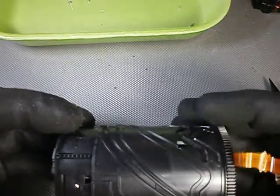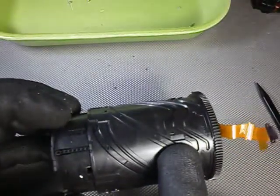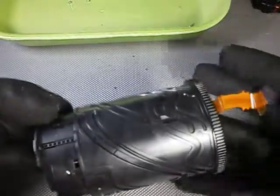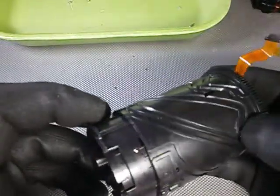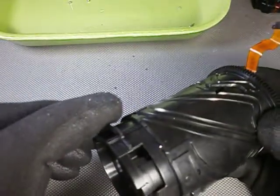Notice that the steel balls of the inner cylinder are held in place by the silicone grease. Now you turn the barrel cam counterclockwise until you see the rectangular hole aligned with the flat cable again. When this happens, the steel ball will be almost in front of the groove entrance. You now slide the inner cylinder until the ball is inside the groove entrance.